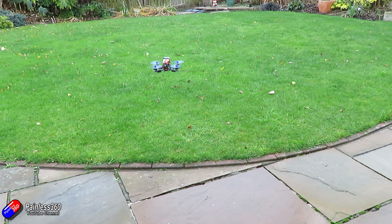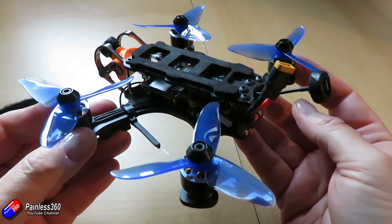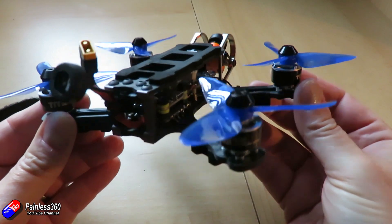I'm almost certainly going to have a much closer look at how the split is performing, because we do need to potentially balance the props. If we're still getting jello in the HD feed - you probably won't spot it in the FPV feed - but with the HD 60 frames per second Runcam Split recording, if there's any vibration at all it will show up. So we may have to balance the motors, come back to that, and then do much more of a test flight. Join me in the next video in the series - now this thing is all together, the work can really begin.